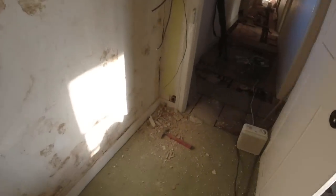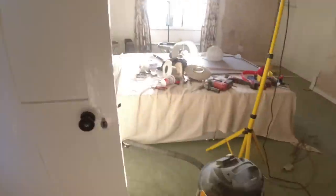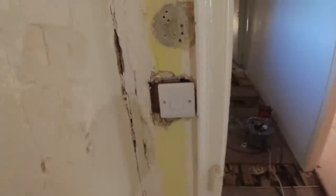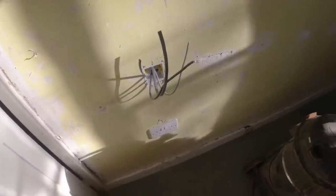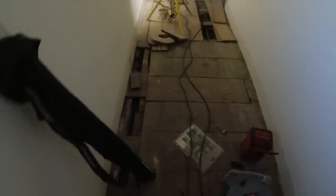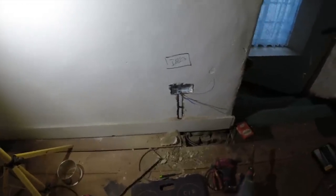So we're going to get on and do a load of chasing now. I just added a bit of capping in there to give them a bit of protection — they're in the wall in zone, and I don't know who the plasterer is. Second fixing this switch — we'll have wall lights, pendant, two-way connected. On mine I do brown from the three-core in the common, then grey in L2, black in L1, switching out L2 and feeding L1 — as long as you keep it the same at both ends it'll be absolutely fine. We've just got a two-way here, a feed in, a feed out, a switch line up to a light. Just stuck a simple pendant up for now. I'm doing the last thing of the day — just finishing off this socket in the hallway. Next week I've got a load of RCBOs coming, then we can get individual rooms on and lighting circuits — that was the whole idea.